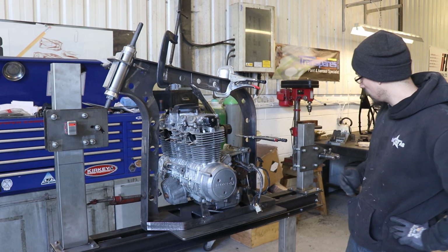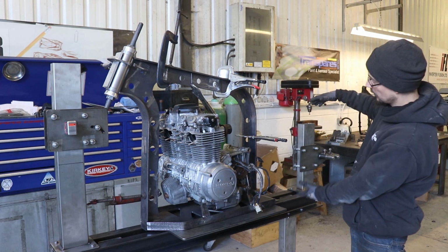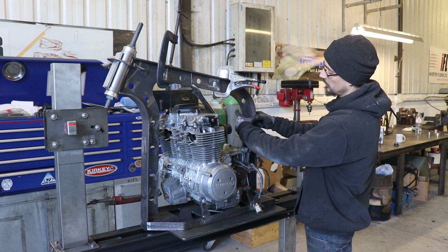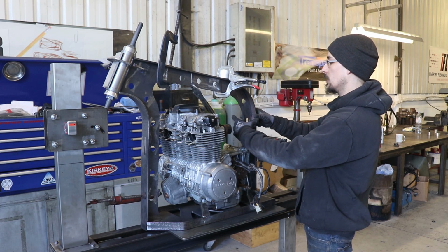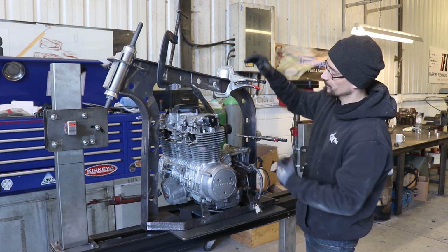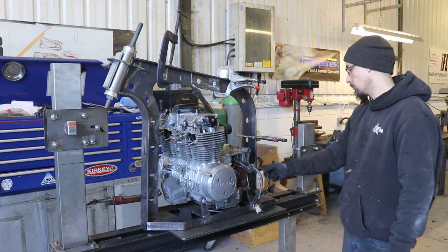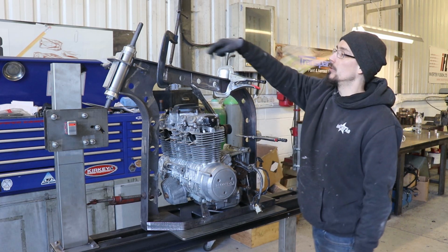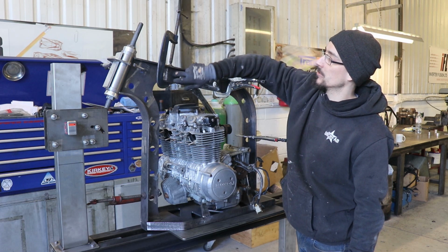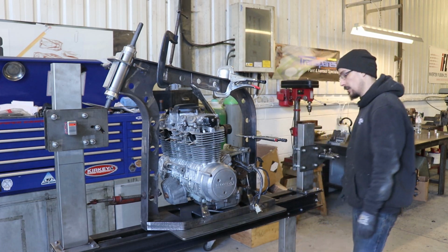So next video I'm going to get all the rear sections cut and hopefully have all this pieced together. I'm going to get a load of U-bolts, like exhaust clamp U-bolts, 65mm ones, so that I can clamp all this and get all the joins really tight before I weld it all. And having all these little cut-out slots, and notched pieces on these, it all just slots together and holds everything perfectly in line.